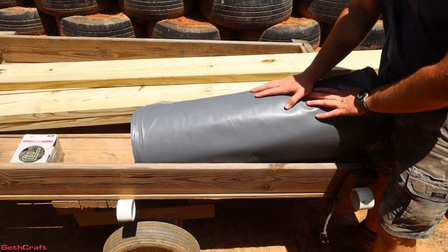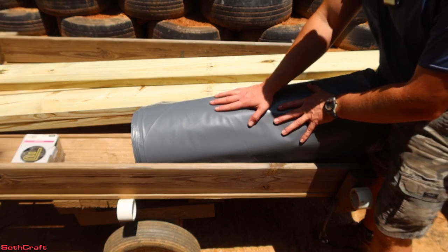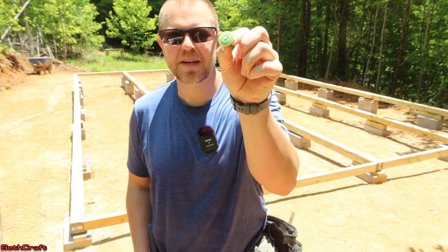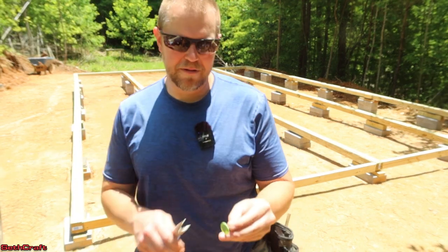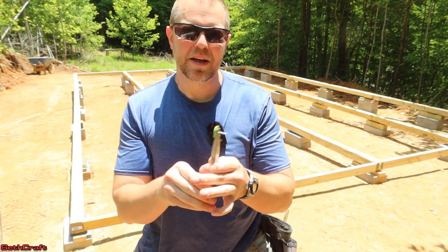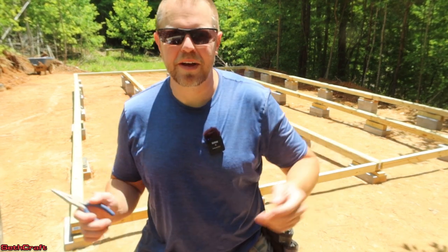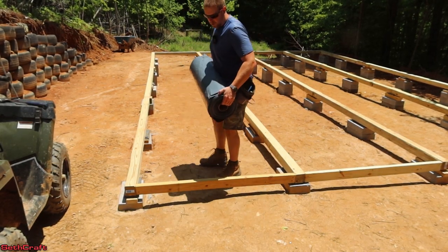I got 20 by 100 because I want to be able to let it fold down along my blocking and be on the ground, so it's easier to work on. I'm going to be installing this moisture barrier with plastic cap nails — just a nail with a piece of plastic on top. I'll be hitting it with a hammer, and I've also found that holding a pair of pliers to tap them into place saves your fingers. They do make a stapler-style nail gun for these, but I don't have one of those, so hammer it is.